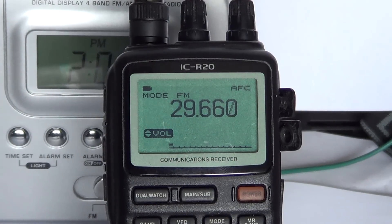In the VHF range, most frequencies are in five kilohertz increments, but there are now spots with 12.5 kilohertz - there was a change of channel spacing in the VHF/UHF ranges. Before, VHF signals were only 5 kilohertz apart; now they are 5 and 12.5 kilohertz. The air band - the airplane band - is 25 kilohertz spacing. In the UHF range you'll probably want 12.5 kilohertz spacing. When tuning amateur radio satellites, I've used very precise 10 Hertz or 100 Hertz spacing because those signals are much narrower.